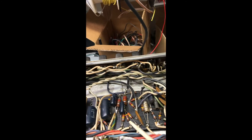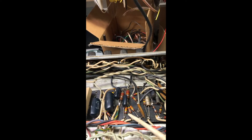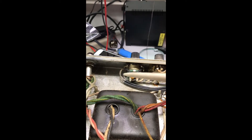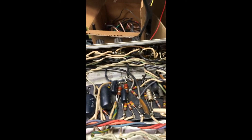You see these Pakistani caps that are not that great. You can see the changes they've made to the phase inverter from the CBS era — they take the signal where the two channels come together, send it all the way over to the master volume right by the power transformer, and then come all the way back. The wire should just go directly from here to here. You can imagine it adds a lot of noise to send it that way, but that's what they chose to do. It's all original, which in this case is not a good thing.